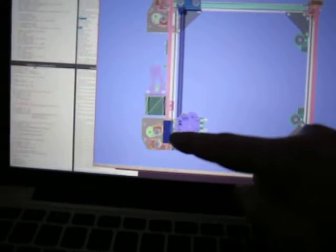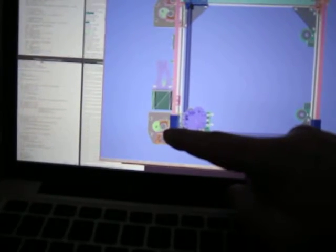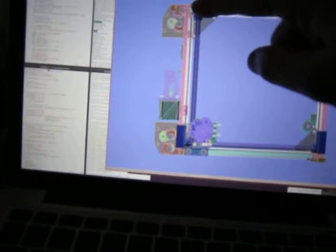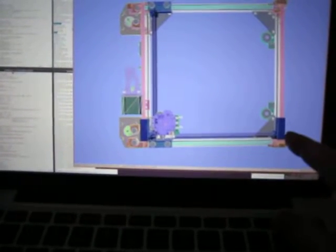round to this, up and down, and that gives you a double pulley arrangement. And it goes across this idler to there, round, and that gives you, that's a GT216, goes up there, round there. Then there's another pair of idler bearings in here. It comes all the way down here, round that one, back there, and then it's at a fixed point there. And likewise for the other one,